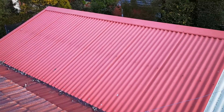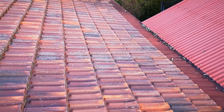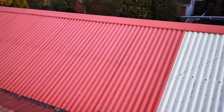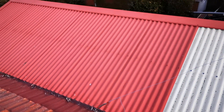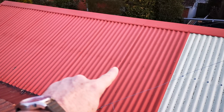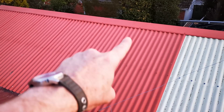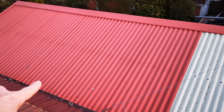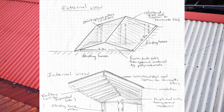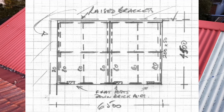Mounting on this thing is a little bit different to the terracotta roof tiles — there's a bit of lichen on those, might have to clean them off every decade. But mounting on here, I can get standoffs. The ridge is running this direction, and it looks like there's a beam running right across there. There's got to be beams going at around 600mm intervals. We can't see it from the inside because it's all fibre board and stuff.